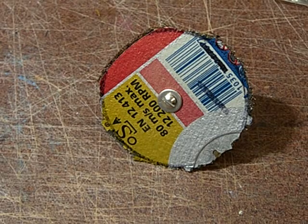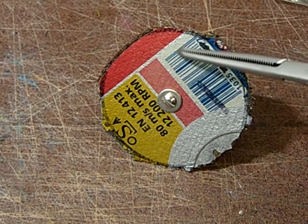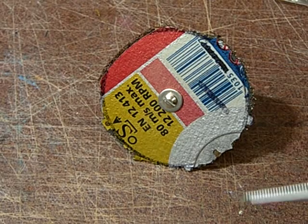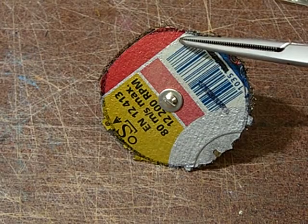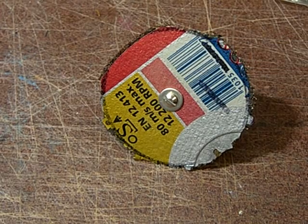This is still a little big and unwieldy, so if you want to cut a tiny wire inside a plane or in some constrained space, this thing might be too big. What I advise is, if you've used it and it has worn down to about half the diameter, you start a new one for the big jobs and save the smaller one for the little jobs where you need a smaller one. After a while you can build an assortment with different sizes and different amounts of wear, so that you have the right diameter for every job you need to do.